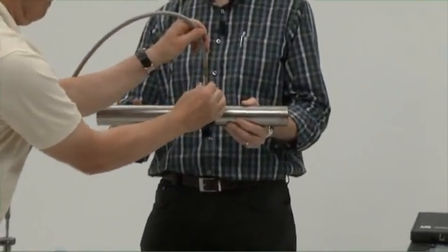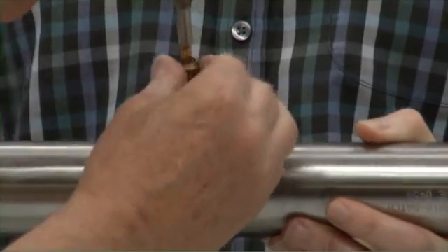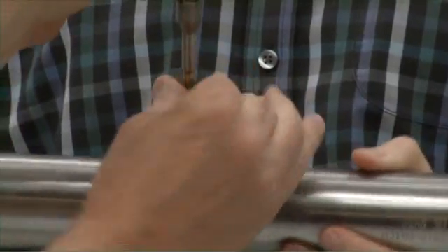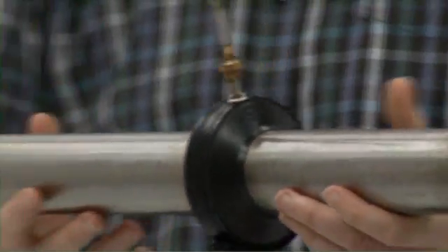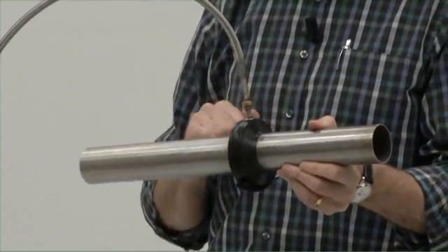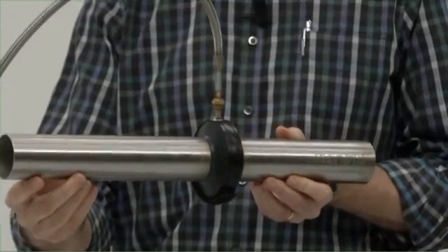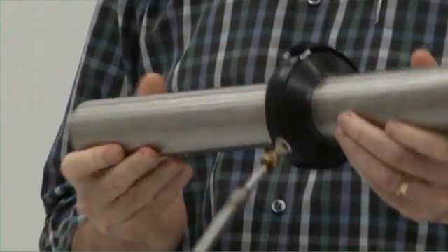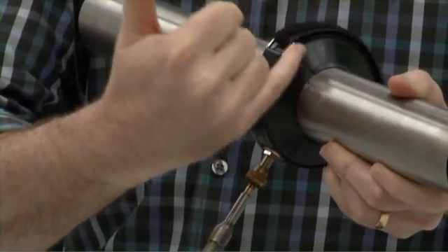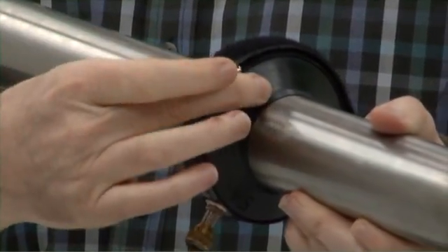The connections are very simple and straightforward. There's a soft seal inside the system and an all-metallic tube, and of course this system could be varied between a short distance and anything up to a few meters. So before we put the system under vacuum, we can have a look at a few of the features. There's now a volume which is trapped around the weld. We have a very soft sealing membrane on both sides of the weld, and there's an interface point where the clamshell is closed with a contacting seal and a velcro system which keeps the contact to keep the system closed.